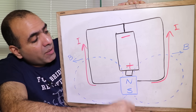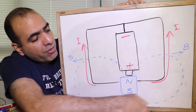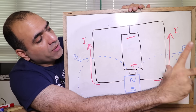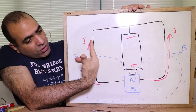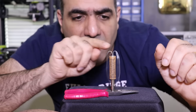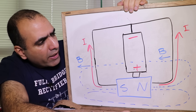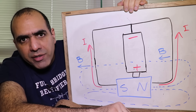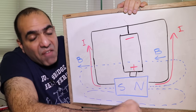The battery sends electric current from positive to negative through both wires. The magnetic field's direction is always from north to south outside the magnet, and south to north inside. Using the right-hand rule, the magnetic field is that way, the current is this way, and so the force is pushing inside the board — basically perpendicular to the plane of the winding. On the other side the magnetic field is backwards, so the force is pushing outside the board. The forces always pull the wires along and they turn. Same thing with a single wire on one side. But if the magnet orientation is sideways, the fields through both wires point the same way, so both forces push in the same direction and it won't turn — it just jumps off the battery. Everything makes sense now!